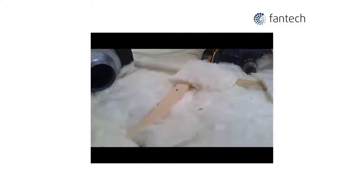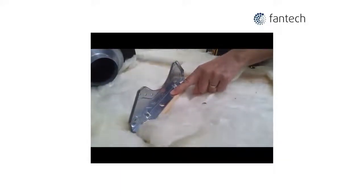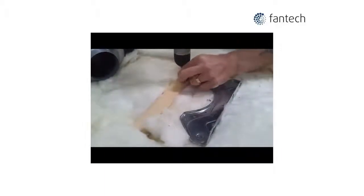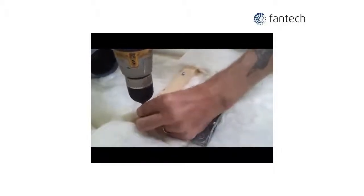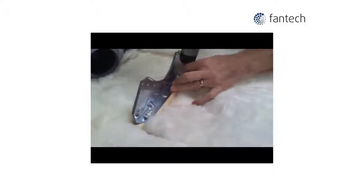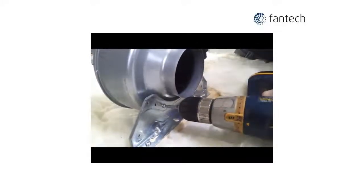At a suitable location in the attic, attach the fan with its mounting bracket to a crossmember or beam, securing the bracket with the two 1-inch wood screws. Ensuring the bracket is secure, attach the fan to the bracket using the short self-tapping steel screws.